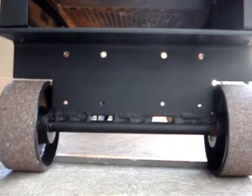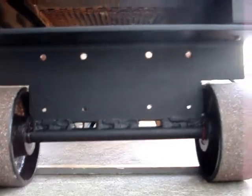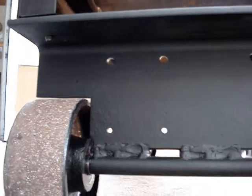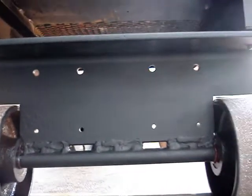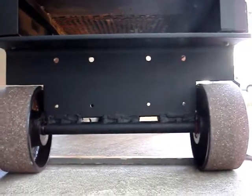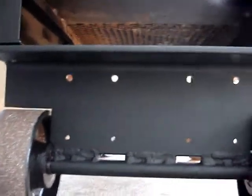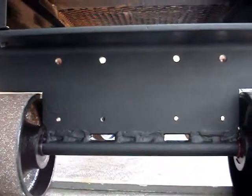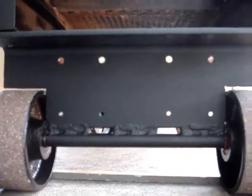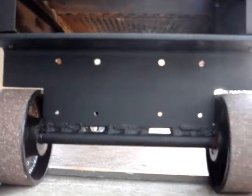This is the rear view of the Dial-Arc buggy. That piece of angle there is four by six by three-eighths. I had to make some little standoffs to make it all come out right — I had to have that axle in a certain place. I made the little standoffs and welded them in. Those holes in there I drilled and tapped. Those are for my tank hanging attachment where I can hang one tank or both tanks off the back of the Dial-Arc.